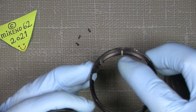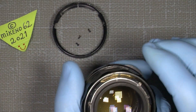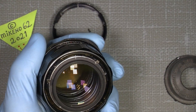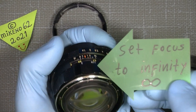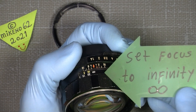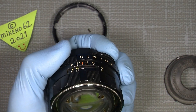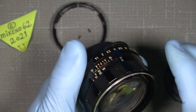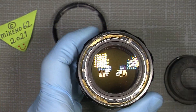I set the mark because there can be something with the filters or so, just in case. Set the lens to infinity — that's my starting point at infinity. If the infinity is not where it should be, it could be different in your camera with a different adapter, but in my case — which could be the same as yours — I simply need to loosen some screws that hold the focusing ring.